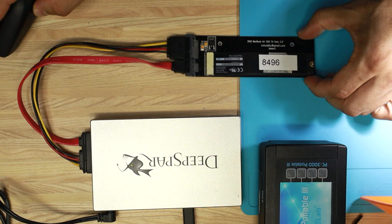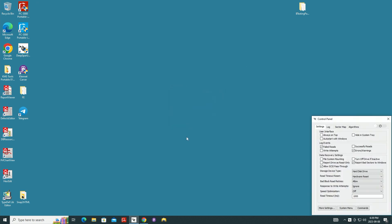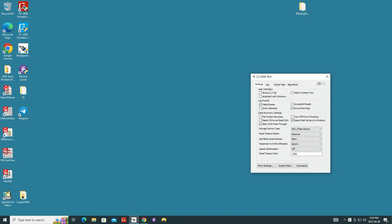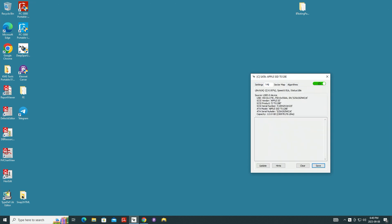Switching to SSD and going to the log. We've got two lines here, but we're only going to use five-volt power up. We get some activity — 400 milliamps. That's a good reading for an SSD. Apple SSD, we got the ID come up, which is amazing.